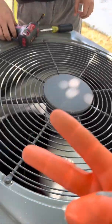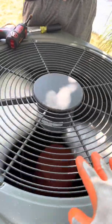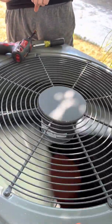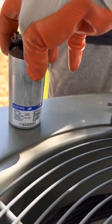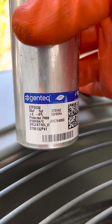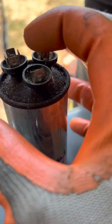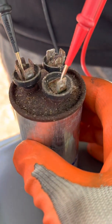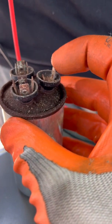This is a dual capacitor — it does double duty. One side is for the fan and one is for the compressor. The compressor side is probably good and the fan side is probably not good. We have this capacitor pulled out and it's 35/5 — 35 UF for the compressor, 5 UF for the fan. The four-spade terminal is common, where the power goes in, and you can use it as a junction point to power other parts of the unit. This one here is normally the Herm — the hermetically sealed compressor — and this one is the fan.